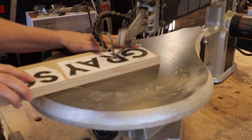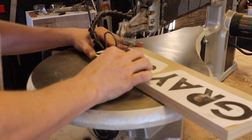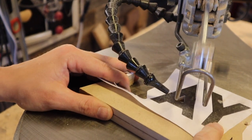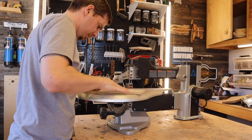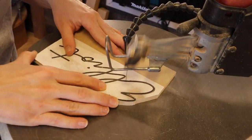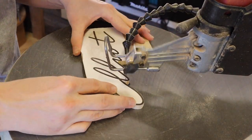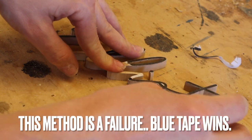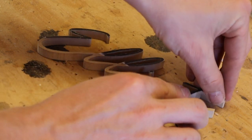When scrolling, you're going to want to go straight for the center of whatever you're working on. Cut out those first because it's easier to do it now than when everything is all cut out and it's smaller and harder to deal with. After that, you'll finish up by cutting out all the rest of the letters. One thing that's been really helpful for me to think about is that things don't have to be perfect. After I've cut everything out, I always go to the one-inch belt sander and round the things that are supposed to be round and flatten the things that are supposed to be flat. You don't have to be perfect on your cuts — I always go back and touch up on all of my pieces.